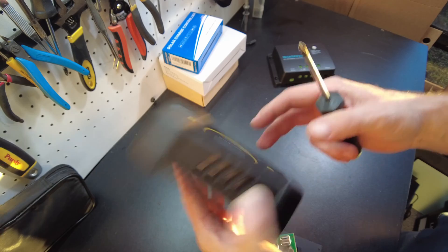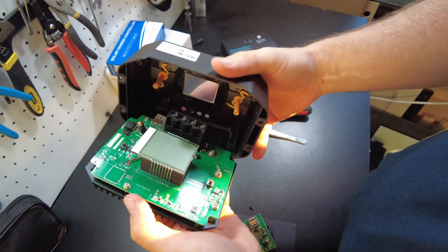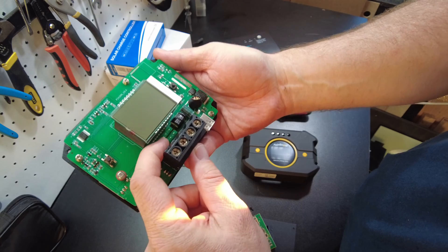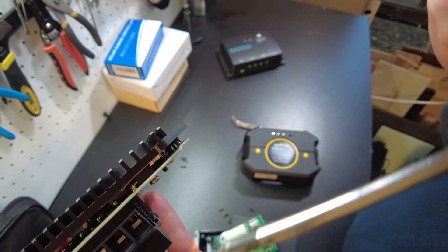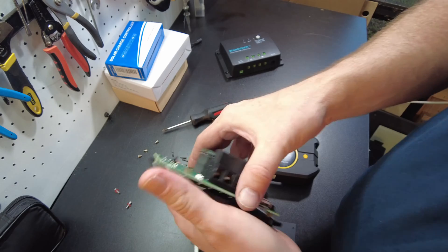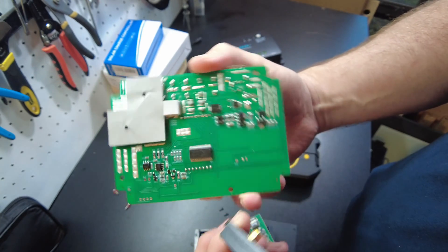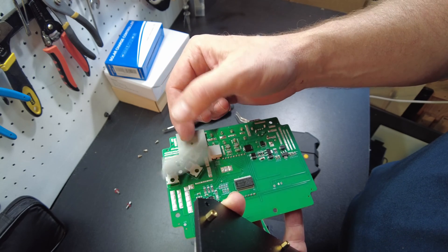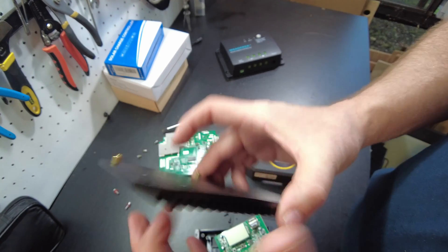Now let's open up the Bouge RV. We've got a bigger board — there are actually some 30-amp fuses in here and a nice chunky heat sink on the back. I do see some MOSFETs here and it looks like there are more MOSFETs. We've got a microcontroller and about four MOSFETs — there's one hiding right there.